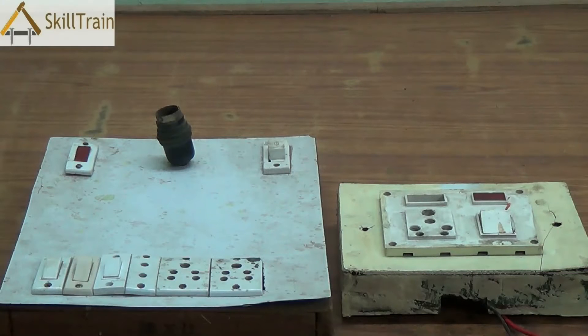Normally all houses will have a switchboard in each room and the switchboard acts as the control point to control all the electrical equipment in a particular room. The phase and neutral that came in from the mains are supplied to this switchboard in each room. In this video we will try and understand a little more about this switchboard using a dummy board kept in front of us.